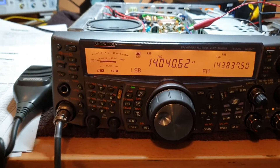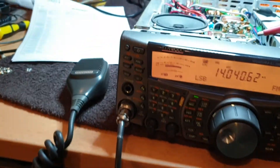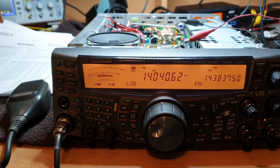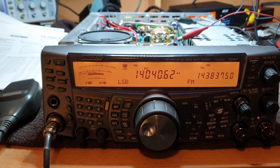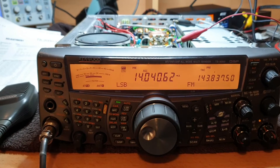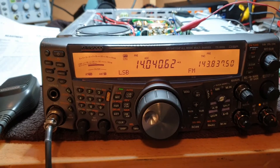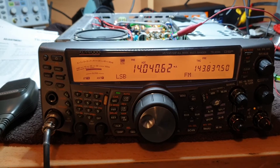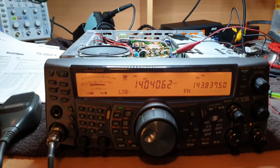I've had a bit of a play with the firmware - all the adjustments, uploading firmware, pages and pages of stuff. I was going to do a run-through but honestly, nine times out of ten people will get themselves into trouble in the firmware menus. It's quite complicated and you can get it wrong. The average tech will be fine, but if you own a TS-2000 that's not getting past 60-70 watts of talk power, this is for you. This one had some much bigger problems - a couple of new boards and bits, and we're cooking with gas.